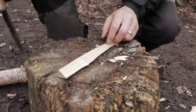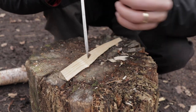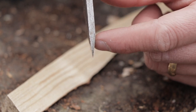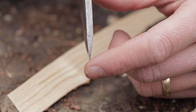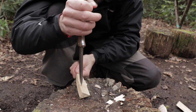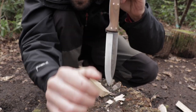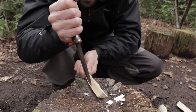The next test is the tip, which I do use a lot with the bushcraft knife. Where the grind and bevel have gone so high, the tip here is really quite thin — it could snap. For this test I'm just going to split the wood by holding the knife like this and basically stabbing down on it. I like to hold it with the bevel away from me, because if I slip, I don't want arteries in my arm running across to the blade. If I were going to cut myself, I'd rather it be my fingers than my arteries. So I always turn the blade away from me.